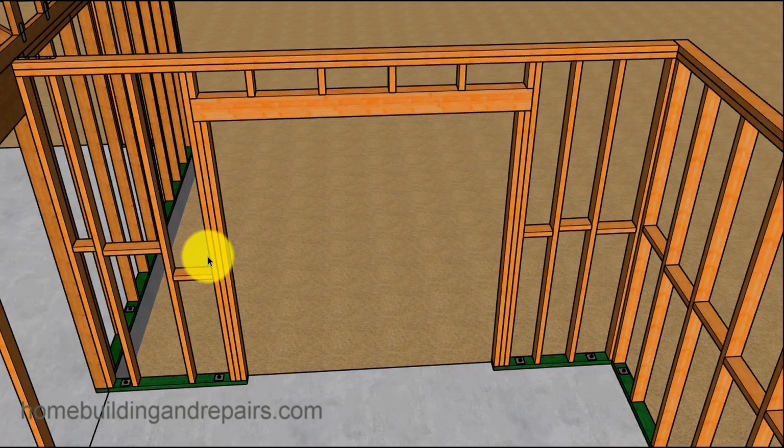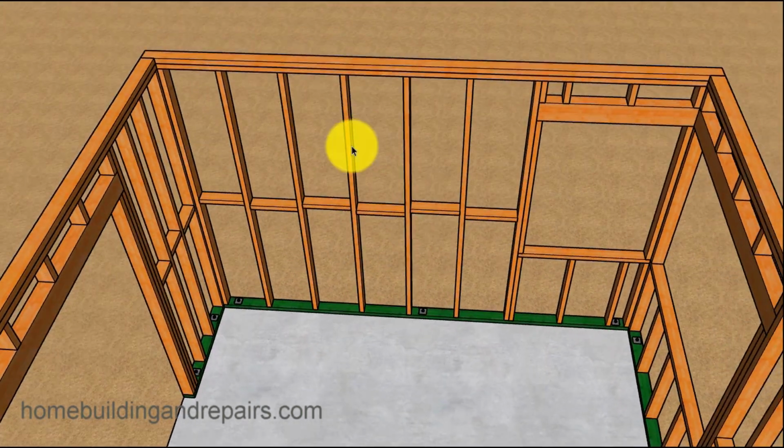If you're going to have a light switch here, then make sure that the framing blocks, the midspan blocks, are out of the way. I always like to lower mine. Some people want to raise them up, but if you think about the door, if you put these blocks in the middle of the walls, we have 8 foot, so these are at 4 foot, and we raise it up, we're not really providing much support for our framing. When we lower it, it's more in the middle of the opening than it would be if we raised it. Just another thing to think about.